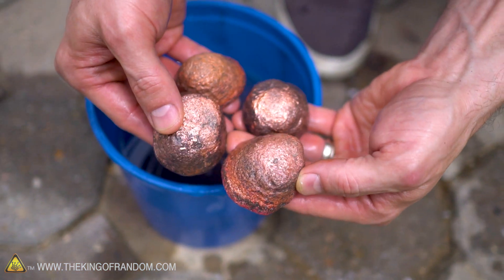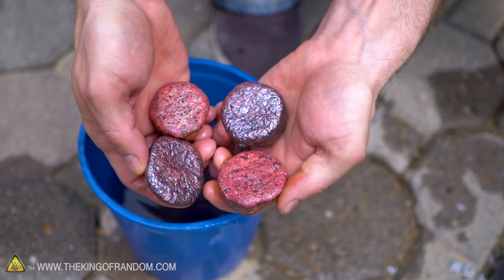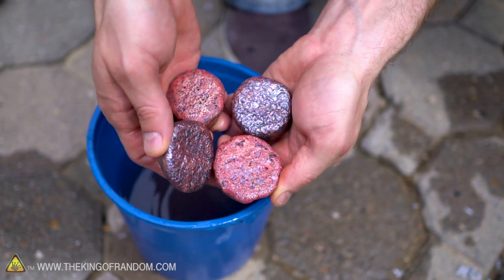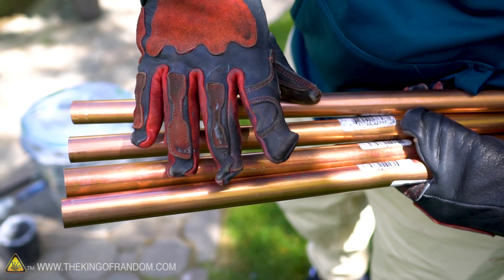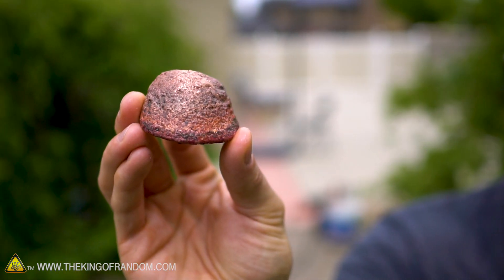Here's the finished result — four little copper nuggets which look absolutely like the holes we carved out in the sand. It is interesting, that magenta color on the top though. It's very pretty. This is pretty exciting for me guys. I know other people have melted copper before, but this is the first time I've tried it for myself. Which means our backyard foundry is getting well over 2,000 degrees Fahrenheit to be able to liquefy this stuff. And this means now we can cast things out of copper, which I think is very exciting. We had four strands of copper pipe and we made four makeshift ingots, worth about seven and a half dollars each. This means our metal foundry takes down copper without any problem at all.